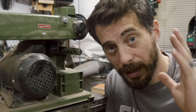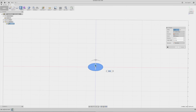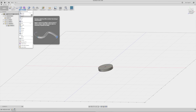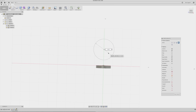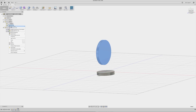Alright, let's head to Fusion and model this thing. In Fusion 360, you almost always start with sketches — these are two-dimensional shapes that you turn into 3D objects. I started by making a circle that was the same size as the port on the sander and then extruded it into a small cylinder. The depth of this is how much I wanted to overlap the existing port. Then, 90 degrees to that surface on a different plane, I made another circle the size of the larger hose, extruded it into a cylinder as well, and used the Move tool to move this new shape off to the left.